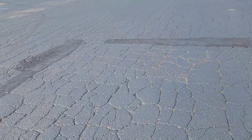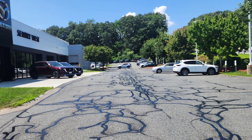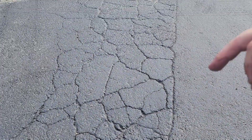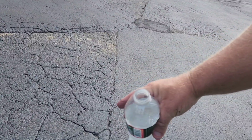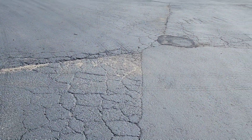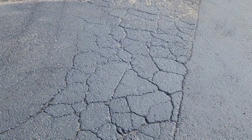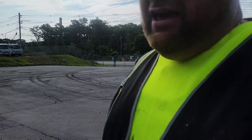But let's say they wanted to crack fill that — how do you go about crack filling that? It's tough because I have like a zero crack fill policy. If I say to somebody I'm coming to fill the cracks in the yard, I'm filling all the cracks in the yard. But when you get tight spots like this, if you were to try to run rubber over all of those and then one of these trucks pulled in and parked on top of it with a set of dualies on a hot day when stuff is soft, rubber squishes up in his tires and as he pulls away he pulls this whole section out leaving a pothole. So that's why you got to be careful about running hot rubber on the edges.